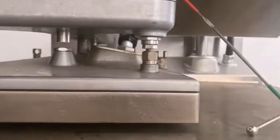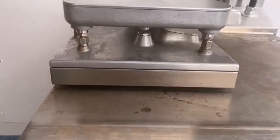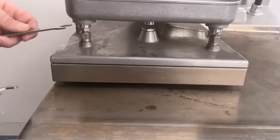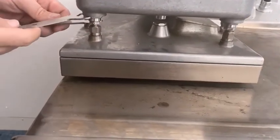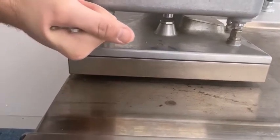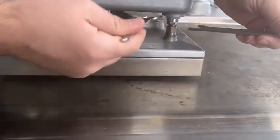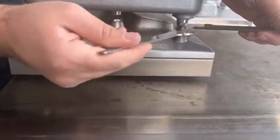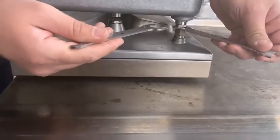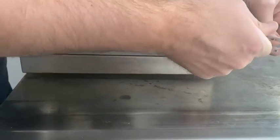That's now perfect. We've gapped the grill and now need to tighten the adjusters. You need two tools: hold the lower nut and use the other side of the wrench to tighten it. It should be nice and tight to stop it slipping. If you don't do this, the gap adjusters are going to come loose, it's going to change your gap, and you'll be back within a week to re-gap it. So both tools, push nice and tight — and that's it.